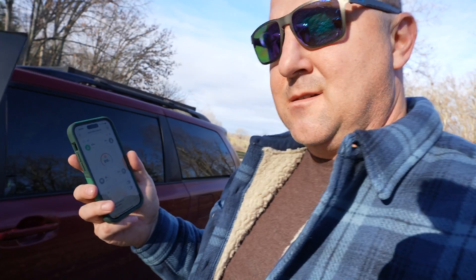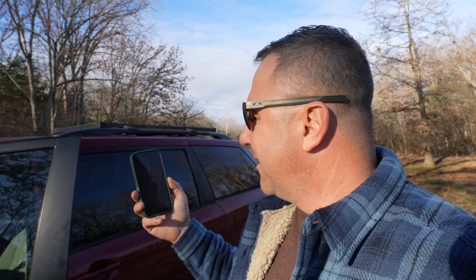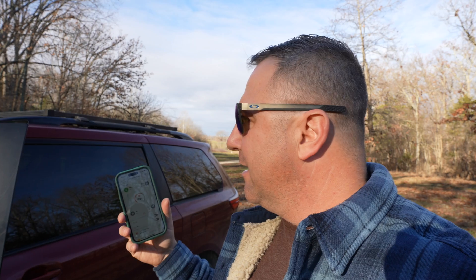I waited until morning to test the solar panel because it was getting dark last night. I think I might have a problem with this setup: my solar panel is putting out 27 volts — I checked that with the voltmeter — and I've got the Bluetti Charger 1 running at 56 volts. I think there's an issue with both of those operating simultaneously. The Bluetti Charger 1 can't react properly to having that solar panel on the output side of it, so I'm going to do some troubleshooting and see what the problem is.